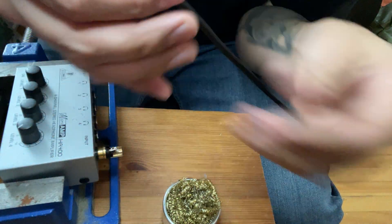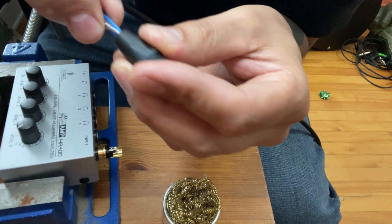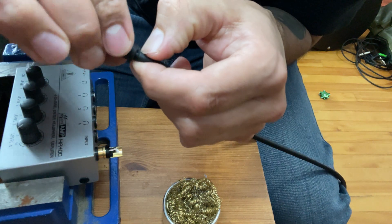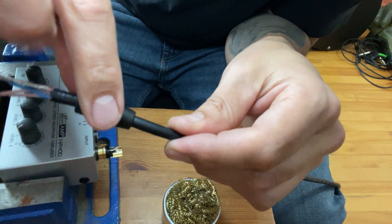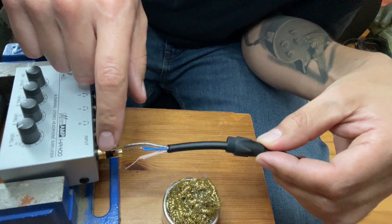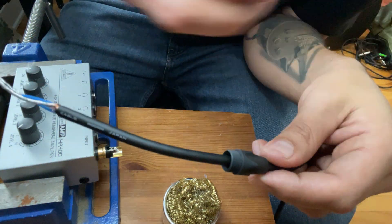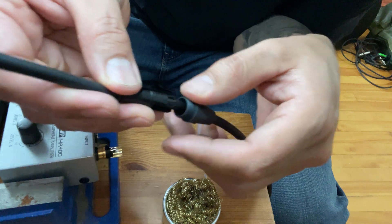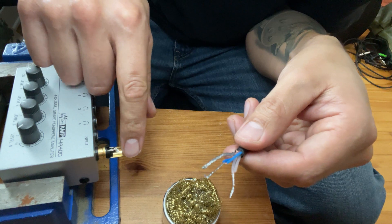Now we're going to try and feed these through — they're still a little warm but not too warm — and yeah, it'll fit. The insulation got a little warm, so don't do what I just did. Try and fit this piece on first — that's a big mistake. If I had soldered onto the connector, you wouldn't have been able to get this on. We got the sleeve on; go ahead and connect this piece with the three teeth facing away from the wires that you're going to solder.